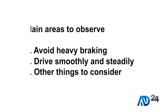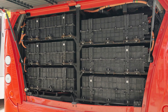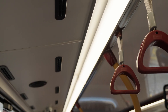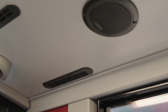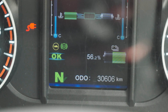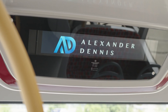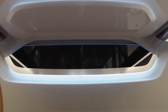Third: other things to consider. Electric vehicles utilize the battery pack which drives the bus. It is also used to power everything electrical, from the interior and exterior lights right through to the doors, heating, ventilation and air conditioning. This means that every electrical consumer in use is reducing the potential range of the vehicle. The vehicle has been designed with efficient electrical components such as LED lighting, which uses less energy compared to conventional lights.